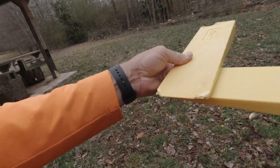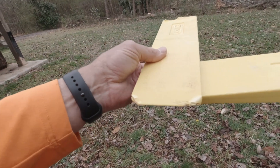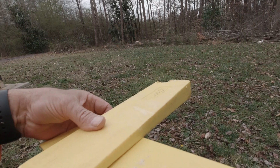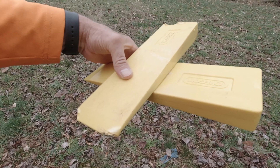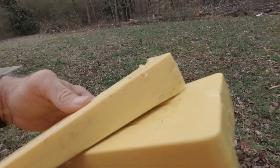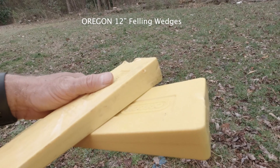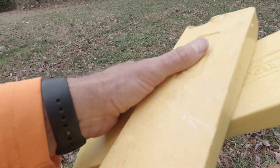This way, going in the back of the kerf, as you drive it in, you have almost a flat lifting action with so much less friction. The wedges — with one as a shim and one as a slider — as you drive both of them in, you end up with the same two inches of lift at the base, at the back. But you have the ability to lift it nice and evenly with a lot less resistance to drive them in.